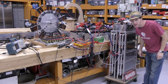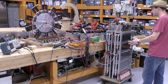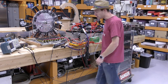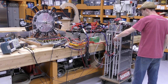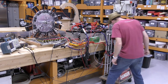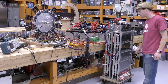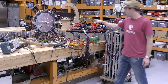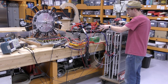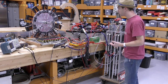Here's what I want to show you: I've got the 10,000 joule capacitor bank connected — both banks connected in parallel. I have to be careful not to touch them; they're only at 24 volts but they are connected. Both banks are in parallel — 3,300 µF, 350 volts DC in parallel, that's maximum voltage. And this is an 8-cell 12 volt battery bank, all connected in series, so I've got about 100 volts basically charging this bank which you can bring up to just under 300 volts.